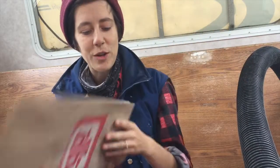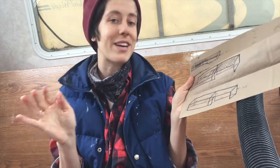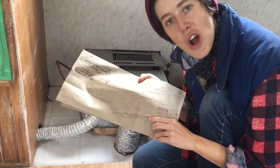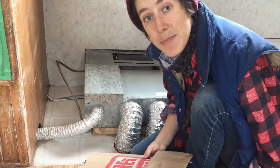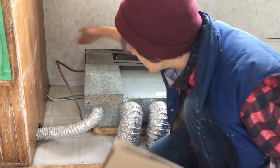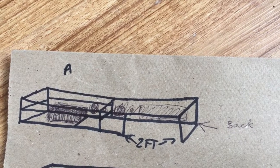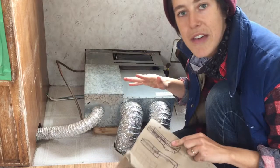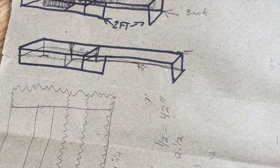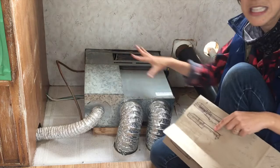It always takes a few times to draw your plan, but drawing it out accurately and writing the measurements accurately is going to save you so much time and so much money from making wrong cuts. So definitely make sure your plan is detailed and you consider all the factors. For example, in our first drawings we drew this couch to be an exact box, but that mock-up didn't actually work because we weren't taking into consideration the things in our environment. Our second drawing starts to consider the factors and has ideas of how it would be best engineered, which brings us to our third drawing. Our third drawing goes off of the second by still taking those things into consideration, but really tuning in on the details of where we need the most structural strength and how that's going to work with the placement of existing elements.